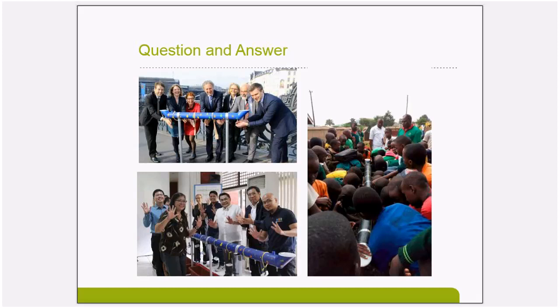You have a substantial surface on the inside, and on this one slide in the presentation of Frederick, I noticed you were using a kind of a brush to clean it. But I imagine you have to clean it every now and then, because there is a build-up of biofilm on the inside, especially if the WASHaLOT is exposed to sunlight. And you know, we have seen the blue pipes. In the case of Uganda, it's maybe a gray or black pipe. This heats up quickly, so the water is pretty warm, and this additionally supports the development of that biofilm.